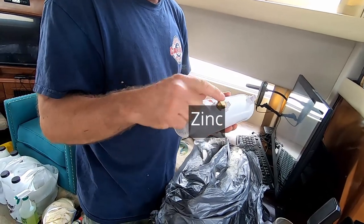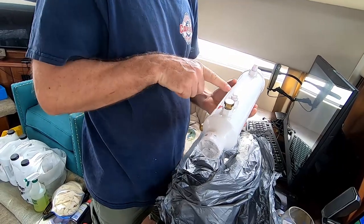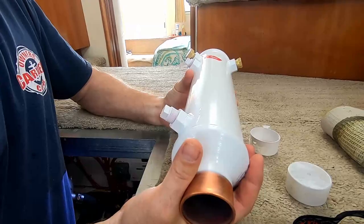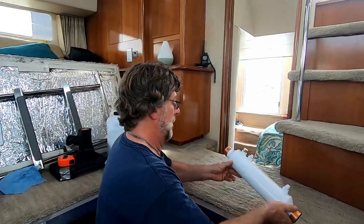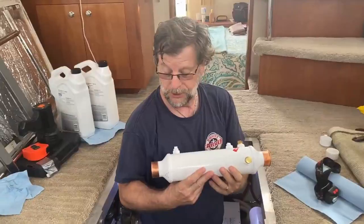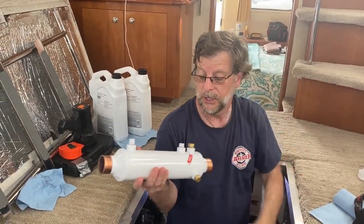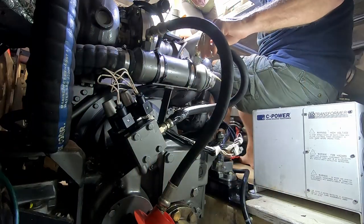That's the zinc, that's the pressure gauge — oil in, oil out. My initial concern was that the ports on top looked smaller than the original unit, and I also couldn't tell if there was a specific direction the seawater was supposed to flow. But on this new oil cooler for the transmission: seawater goes in here, comes out here; oil goes in here, comes out here. So it's the seawater that's keeping the transmission oil cool. It's time to put it in.